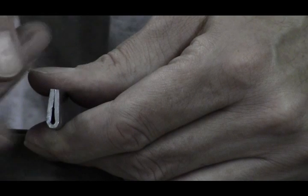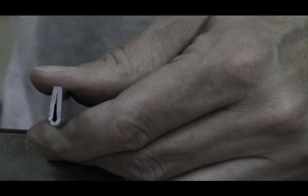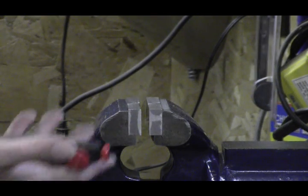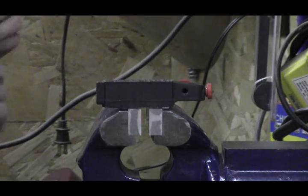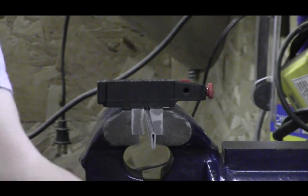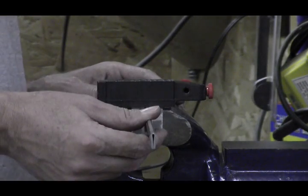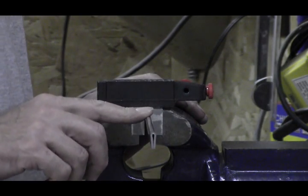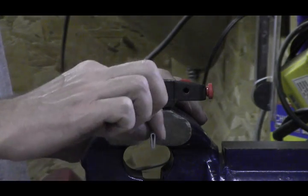The one on the Jackson's a little bit wider — this one's only about 5 eighths wide after it's bent, but since this is a small dovetail saw, I think that'll probably be fine. When I was making the back and got it home, it was quite a bit wider and the bend radius at the top wasn't pinched nearly tight enough. So I made a set of smooth jaws for my machinist vise, used a magnet set across the top, stuck the back in there with a cheater bar, and worked it through, continuing to refine the thickness on the back until it was set at 210 thousandths. This is 14-gauge steel, so that's about as tight a bend as I'm going to get on it.